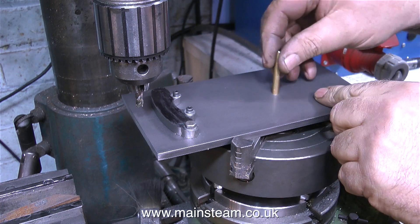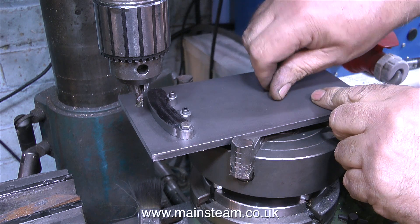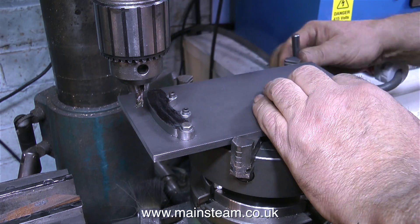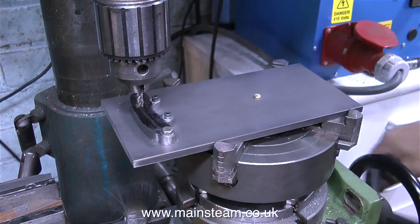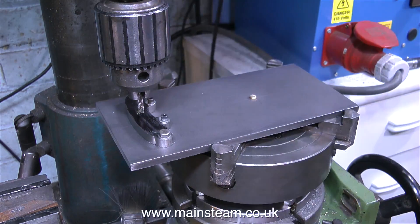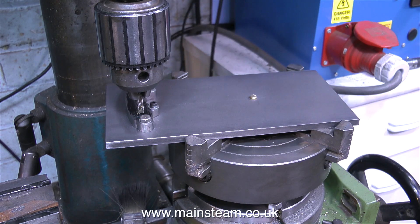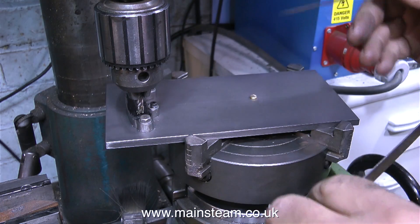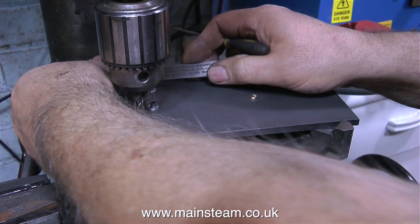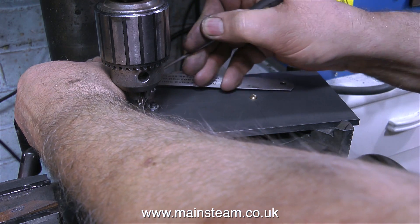After which I can fit the entire assembly into the four-jaw chuck, and a piece of brass bar goes through the hole in the centre, down into the fitting that I made earlier, which centralises the whole thing. All that remains is to tighten the jaws of the four-jaw chuck and adjust the position of the milling table and the rotary table so that the part is precisely positioned, ready for cutting. Before starting the cutting process though, I marked some lines from the centre point to show how far the cutter needs to go.